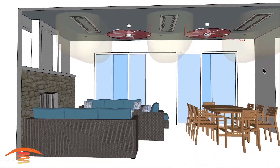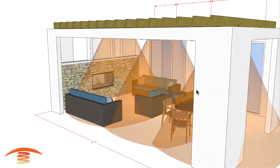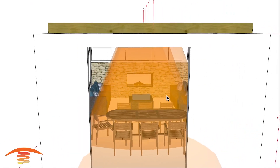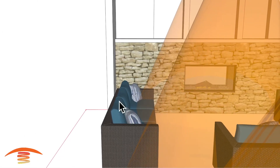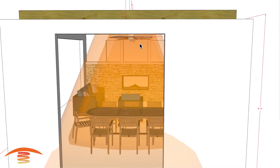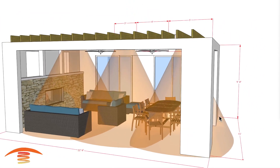Let's go ahead and look at the footprint of heat. In this configuration, the footprint would be fairly decent, but you can see we're not heating up the seating positions on the left and right as ideally as I would like, nor are we on this side with the 6,000-watt units in the center of the patio. So let's look at another option.